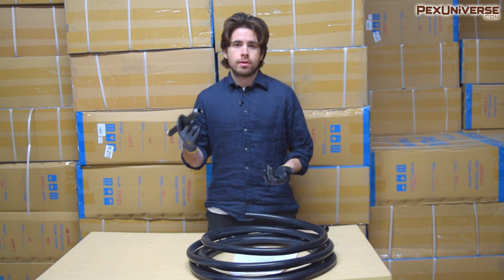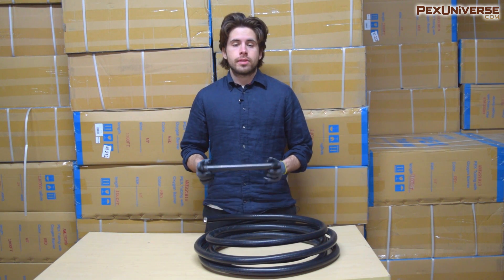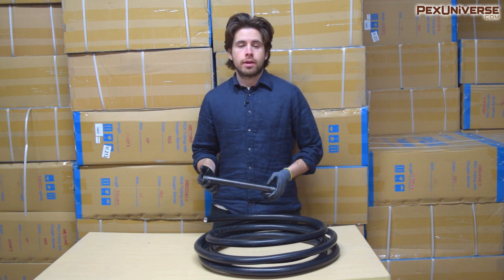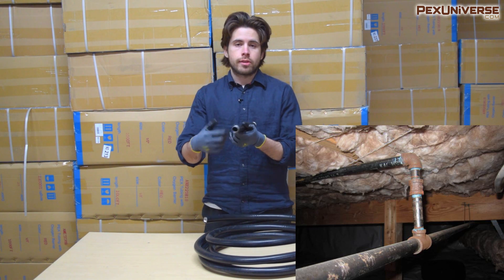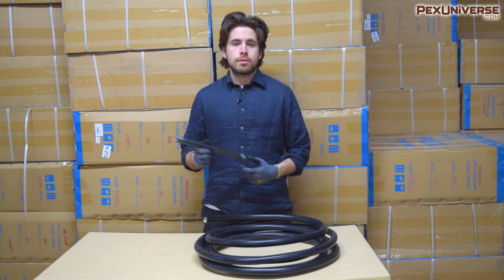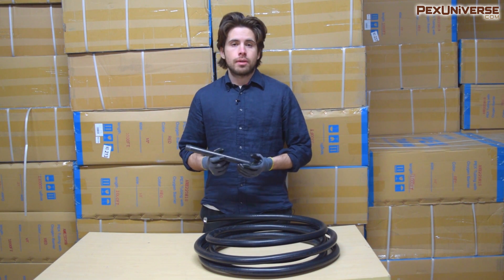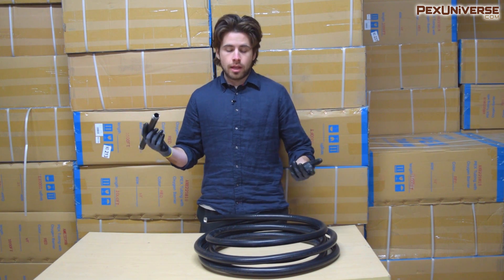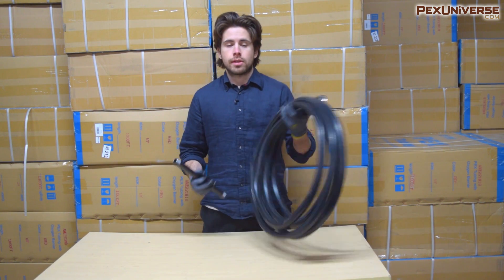Black iron pipe is very sturdy, so when you're holding it in your hands it just seems more reassuring since it's heavier. People have more confidence in that. However, a downside is that if black iron pipe is installed in an environment where there's moisture in the air, it'll corrode over time — the inner walls thin out, and obviously this will cause leaks given enough time. And while the sturdiness is an upside, carrying it to a work site is a lot harder than carrying CSST.